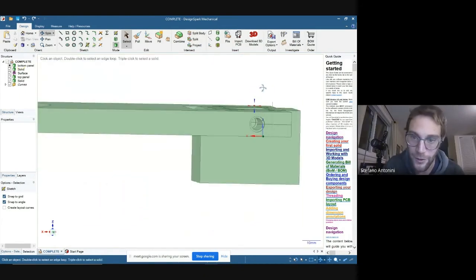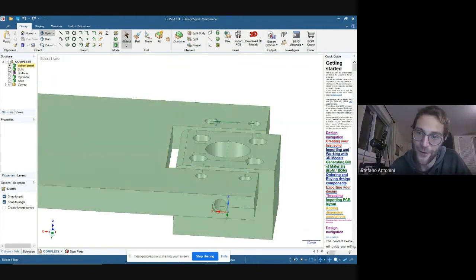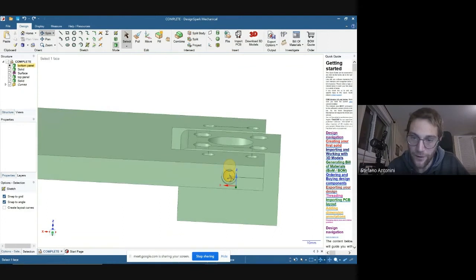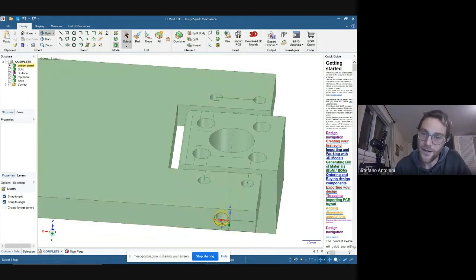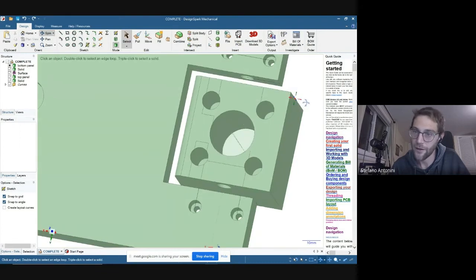We designed the pivoting panels a little bit more precisely than that model. We also have some holes for a backup plan that we didn't need to use, so I won't talk about it. But here there are holes that go from the left to the right, and small holes here, to have three for each side. We have three bearings. Then we put a metal shaft passing through this hole and ending in the third bearing, which is in the pivoting panel. And the same thing on the other side.